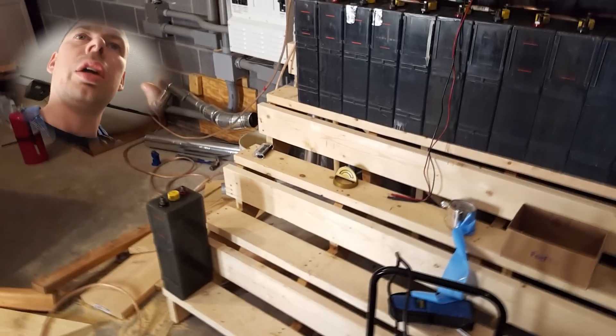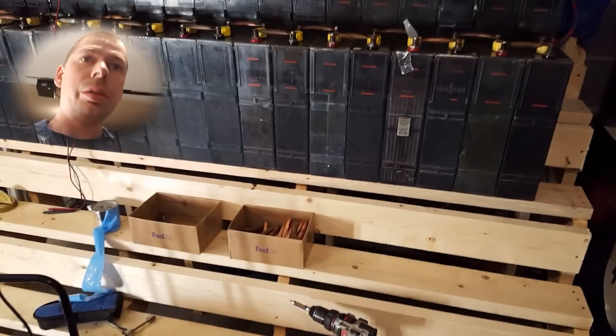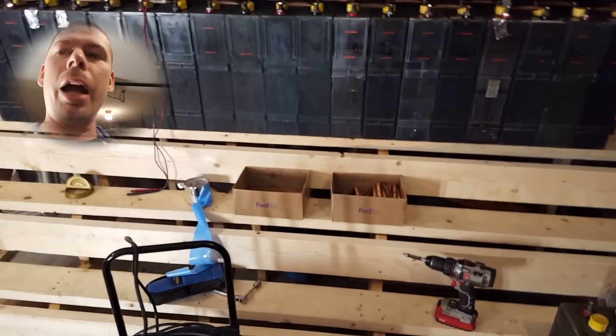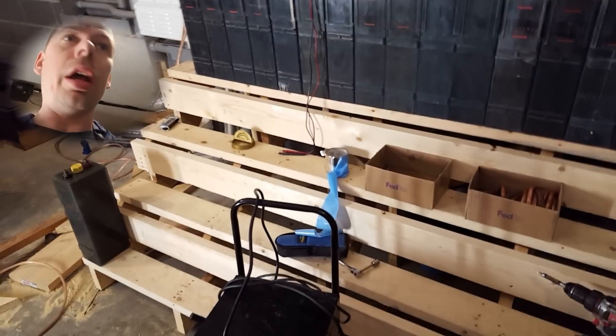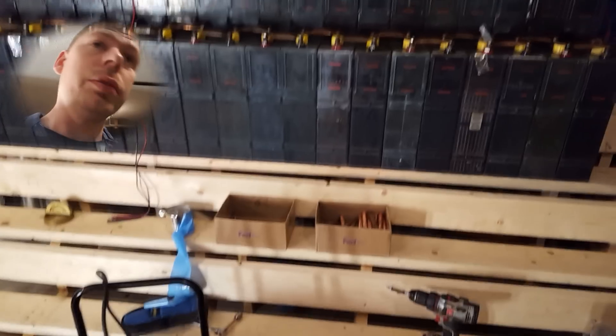I'm going to take those five out — these two will be easier to replace. I'm enjoying it, it's a pretty fun experiment so far. What I'm doing to test is discharging them late into the night, checking voltages during discharge, and seeing which ones have lower voltages — those are the lower-capacity cells. You can also check during charging: if one has a higher voltage than the average, you want to swap it out.